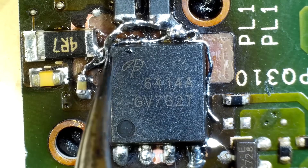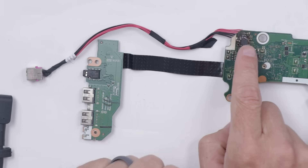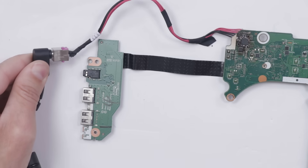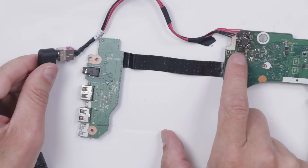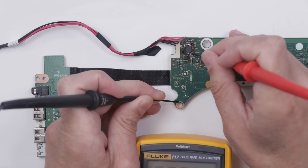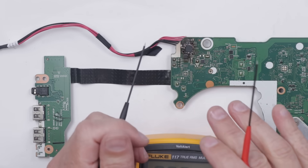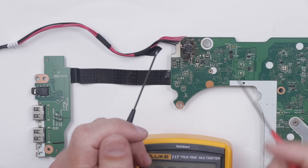Another job that is very ugly, but at least should get the job done. Now with that MOSFET replaced yet again, let's plug it in and see if we happen to get lucky and it works. Bummer — no LEDs, nothing going on. Let's check voltage: 19 volts in, zero volts there, zero volts there. I'm not really sure what I'm missing here. There's got to be something because this MOSFET is doing the exact same thing as the other one, and it's very unlikely that both are bad.